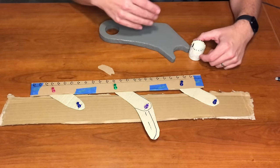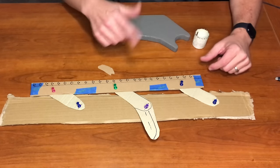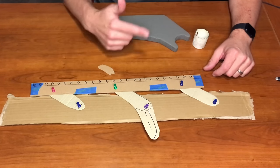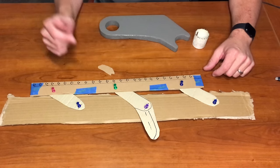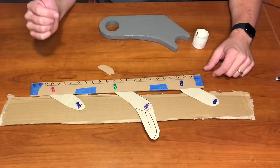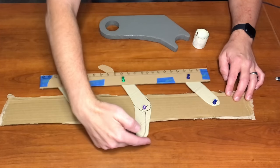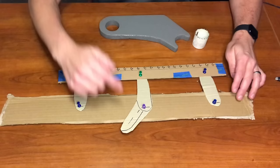And then it just goes back down, goes in reverse. And then once the train is back into the station, a lot of times you come back into the station when it stops. That's when you hear a hiss of air come from lift two. That's pneumatic rams pushing the other way and raising the trough back up.